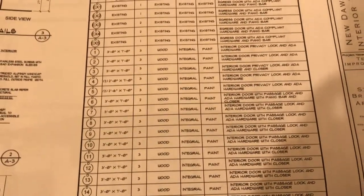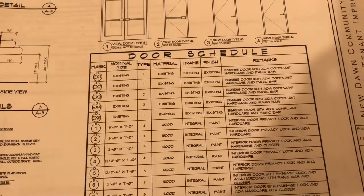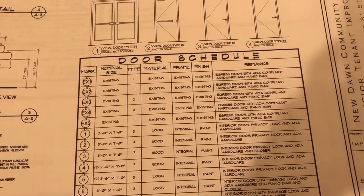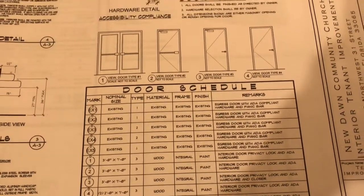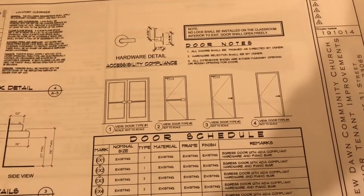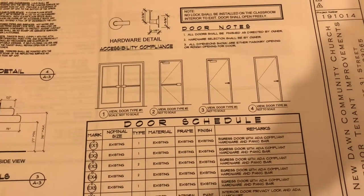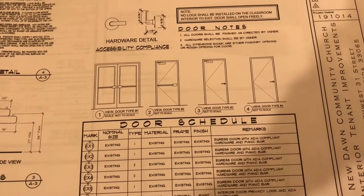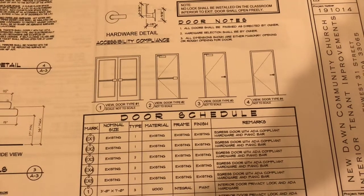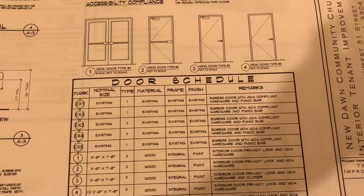First, do your layout so you'll know where the walls go, and then you start doing your exterior walls with your furring, or what we're using, the 7/8 metal hi-hat, so you can run through without having to go in and out of the walls. So do that first after you finish your layout.